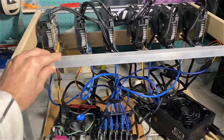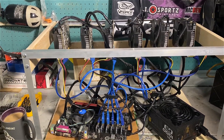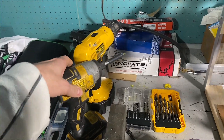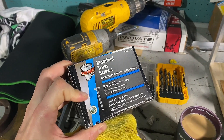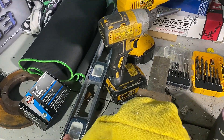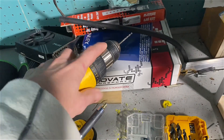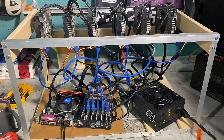I'll put in the description below the article I found online that showed me everything I needed to use. I did modify it a little bit. I'll show you some measurements — I have my tape measure here. The other gear I used was my impact gun with tips, my drill, a box of self-tapping screws, a level, and my drill bits. Right now I have my 1/8 inch drill bit in my drill, and I also used my 3/16 inch drill bit.